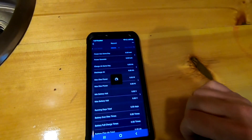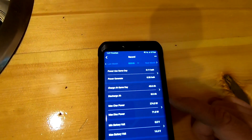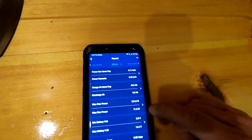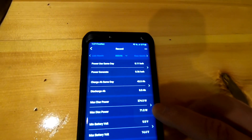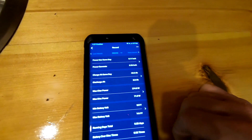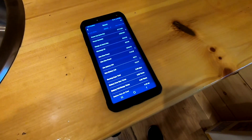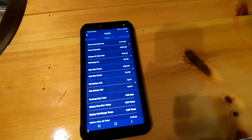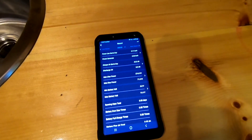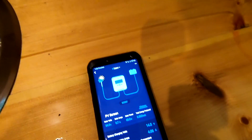If I click history — I've only had the system up a few days — it shows my max charging power has been 274 watts. So with 400 watts of solar panels the maximum I've been able to pull in at once up here is 274 watts — not ideal. That's why I went with twice as many solar panels as I calculated I needed. Ideally I only needed about 200 watts for what we do in this cabin, so I went with four instead of two panels — that way I can get more watts with less sun.